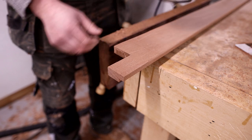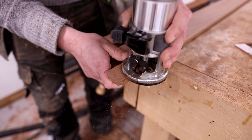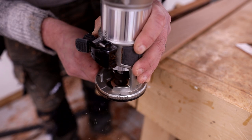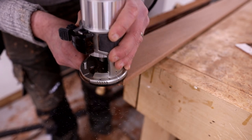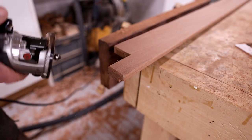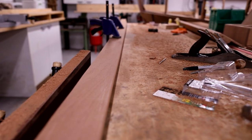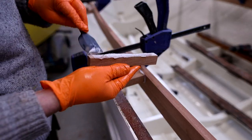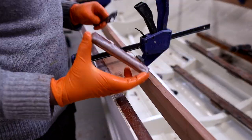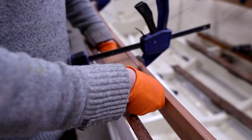On the internal finished edges they're just rounded over. I'm using my little trim router with a small round-over bit, softening all the edges that will be exposed once it's finished. These carlins are actually upholstered and I wonder if they were finished wood originally because they were done in mahogany — quite nice looking — and rounded on the internal edges. Some of the boats may have not had upholstered ones, I'm not sure. You can also see me gluing a little cleat in there underneath the block that spans between the two.